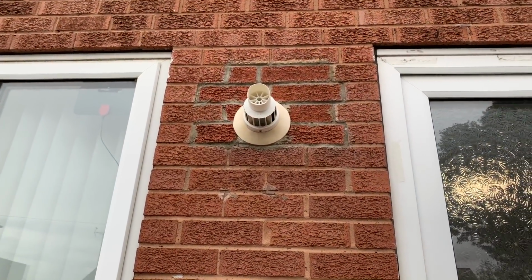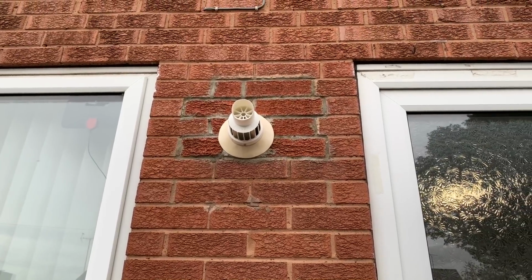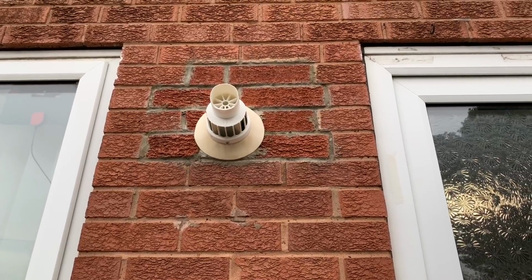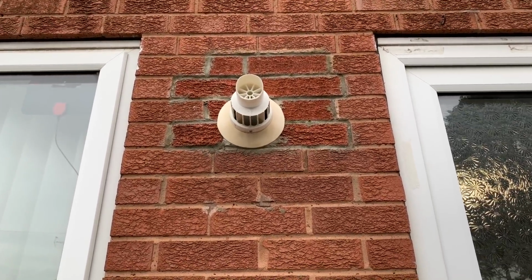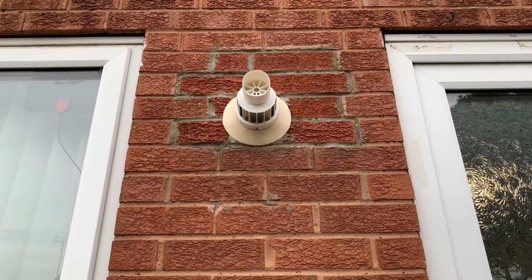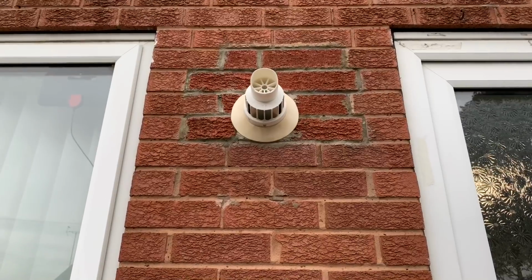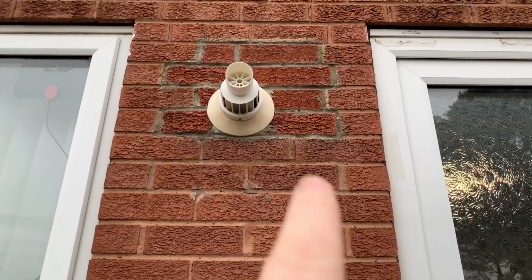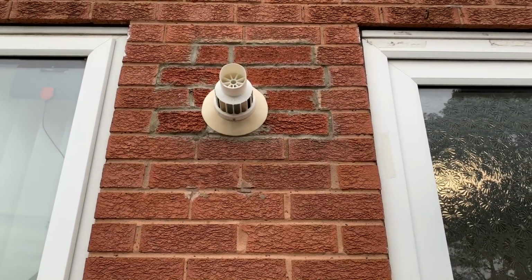they're installed. So first job I've got is a Baxi Platinum that I installed, so we'll go and have a look at that. Yeah, let's go in and have a look. So this boiler here, this is a Baxi Platinum, and it was a balanced flue boiler, and then we bricked that up. If you have a look at the brickwork, it's quite neat, and the flue, we've got minimum 300 millimeters, so 30 centimeters from this side and 30 centimeters from this side. I think this one were about 32 centimeters.